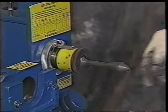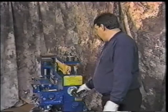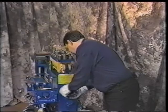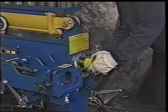Okay? Next thing we'll go to is a 45-degree flare, and you'll note over here it says flare. So we're going to use 2 1/4-inch tubing. You'll look straight down from that. It shows you want your setting on a round 6. So we want to turn this machine then to where it comes around to the round 6, again in that sight hole.